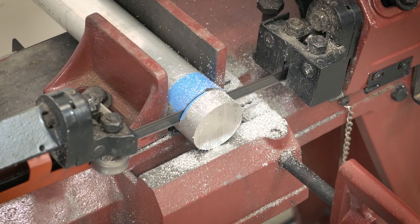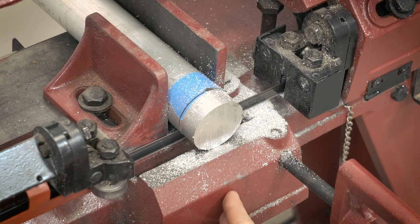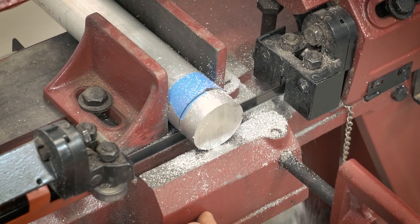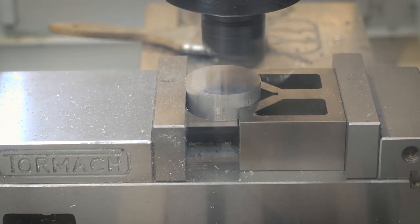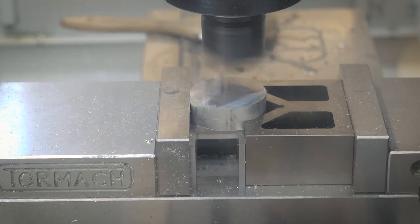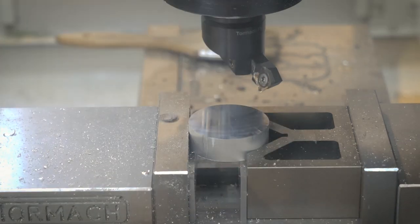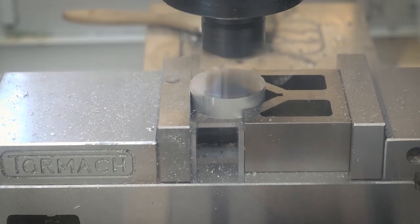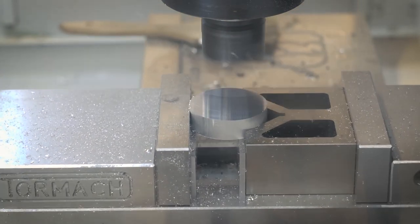The first step in making this part was to take some stock and cut it down to size on the bandsaw. I had some stock that was 1.75 inch in diameter, and the pulley was going to be one and a quarter inch diameter, so that would work out just fine. The final size of the pulley is a half inch wide, so I cut off a chunk slightly larger than that — around 0.62, so about five-eighths inches long. I then needed to size this stock down to exactly one-half inch. I decided to use a V-block and the Superfly to face off one side, then flip it over and face off the other side down to the final dimension. I just did it on the mill mainly because I don't like the chuck on my lathe.